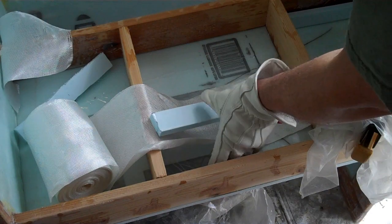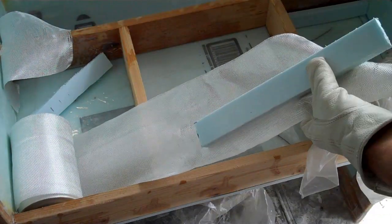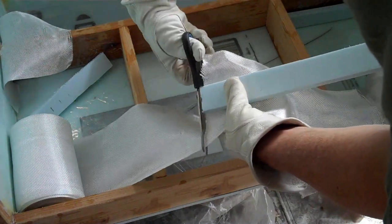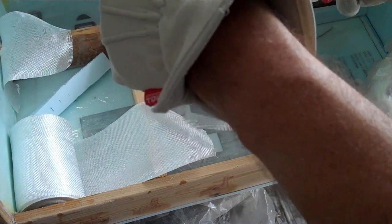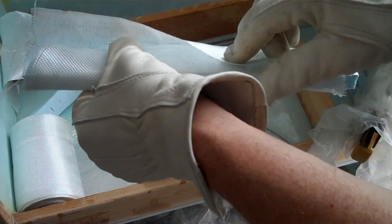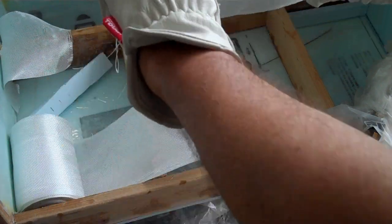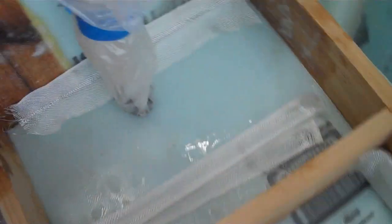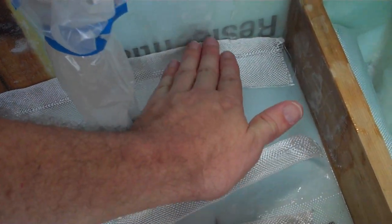It would be more cost-effective to cut strips from my giant roll, but from a convenience standpoint it's hard to beat fiberglass cloth tape rolls — they cost a little more per square foot, but if you have the right widths it's really nice to just have it ready to go. I can say there's one wrap, wet it with epoxy, wrap it around tightly, and set it where it needs to be. I'm using six-inch wide cloth tape to wrap around the spars one and a half times, and two and three-quarter inch tape to cover the holes and bond to the sidewalls. I have two one-inch pieces for the corner — three total layers at the corner and one layer extending farther out.